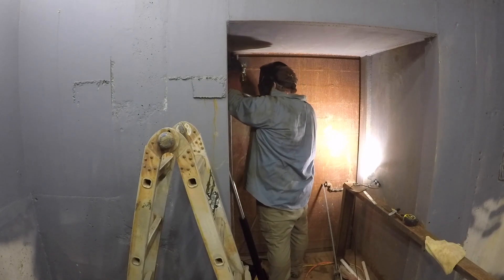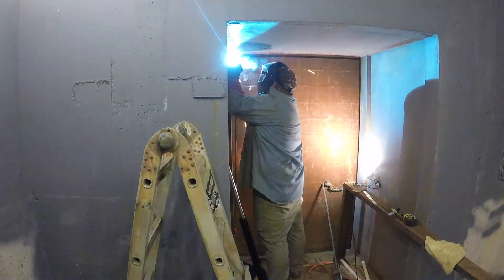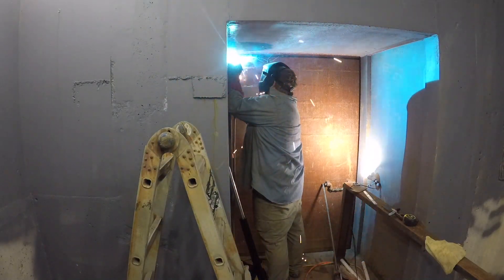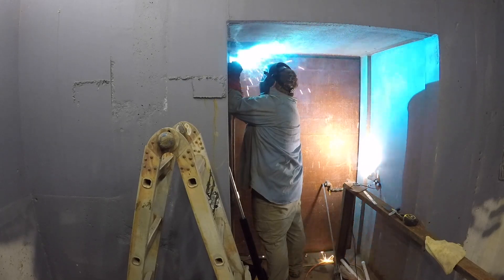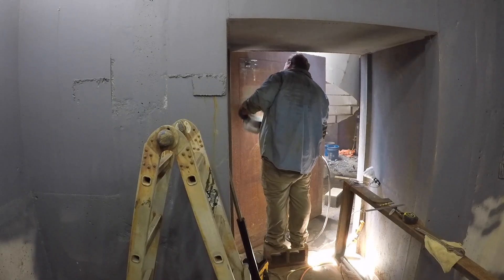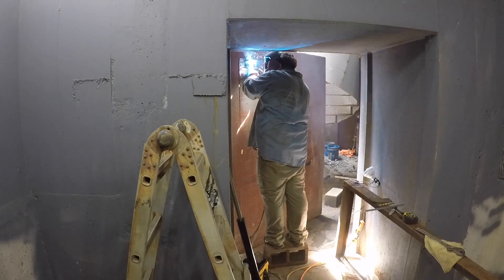This is the inside view — we're in the first room, the first room you walk into in the missile silo. What we're doing is I'm welding these brackets on here. There are going to be two brackets that go onto the blast door. This is pretty tricky — I had to do this over and over again to get the angles correct. The hinge of the door is not like a door for your house where the hinge is right along the edge; the hinge is about 18 inches outside of that, so the way it opens is kind of interesting. I kind of had to mess with those angles quite a bit.